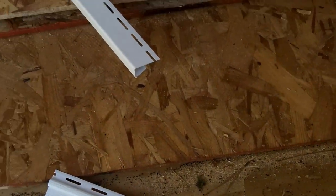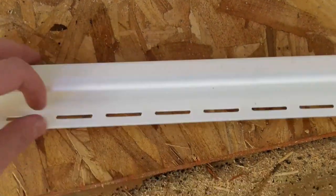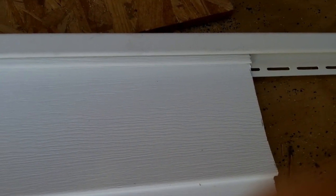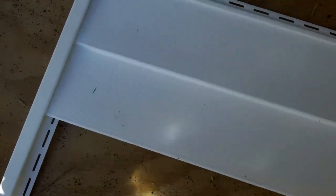They hook together really well — you know when you've got them hooked together. There are also these types of pieces that have a nailing strip on the bottom and a pocket inside. These are for the top — so at the top of wherever you're running your siding, you tuck that in there. Or if you've got a door or window, this stuff goes into the side. So it just tucks in — a lot of little pockets and crevices for the siding to tuck into.